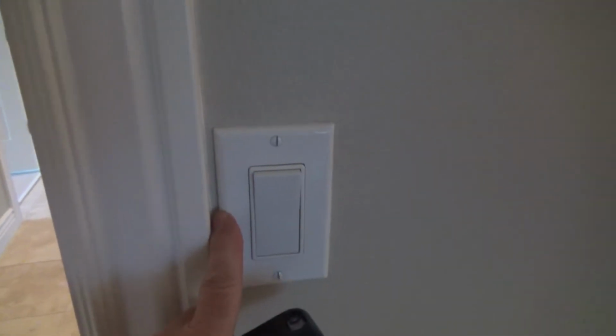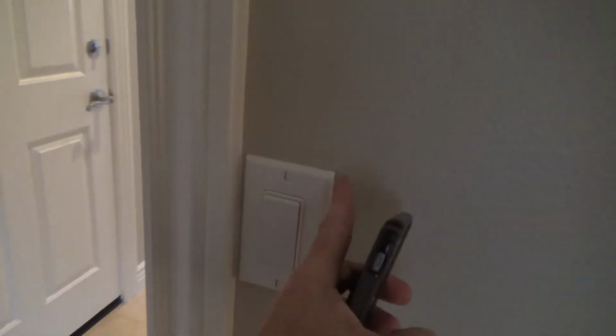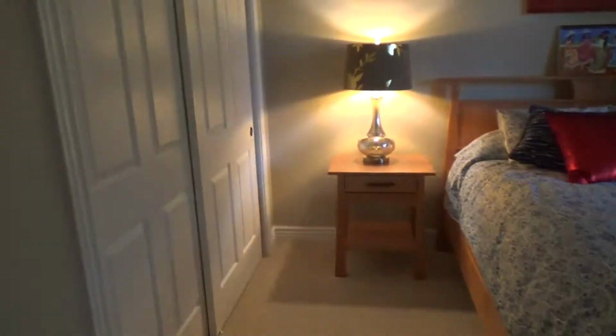I'm going to have to get that out of the store, a long flexi bit, because there's probably fire blocks in here, because the walls, like the ceiling's like 10 feet tall, and usually you have a fire block in here somewhere. And I'm not sure why they have this light switch so close to the door. Usually they've got a nice gap. Usually it's about from here over, but they didn't. And so I'll have 2 switches here. One paddle switch. The first paddle switch will be for the ceiling fan. Second paddle switch will be for these lights over here, because I hit the switch, boom, those go off.